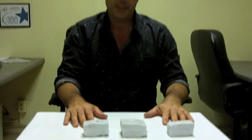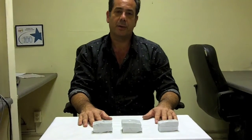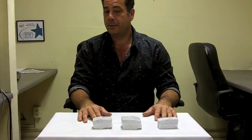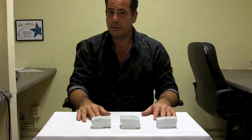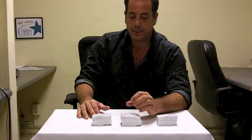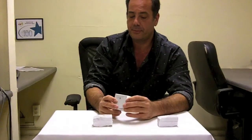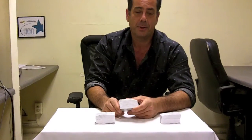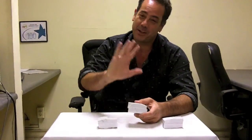So here we are. We did three tests with the solid clear glue. I recommend 12 hours of drying time. We will try with additional hardener, but I think the more hardener you put in and the faster it dries, the weaker the bond. These are very strong bonds, and at least now we have answers to some of the questions customers have been asking us. I'm signing off until next time — thank you very much, we'll see you next time.